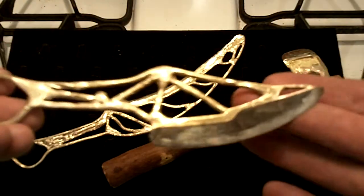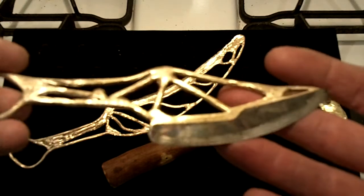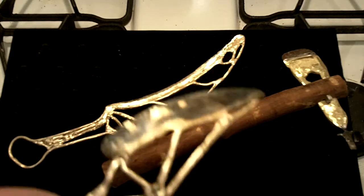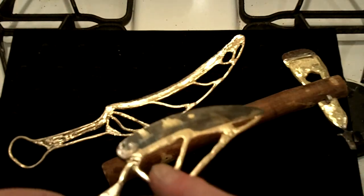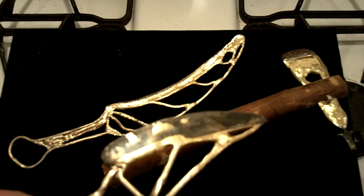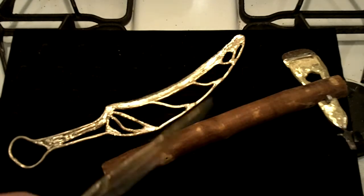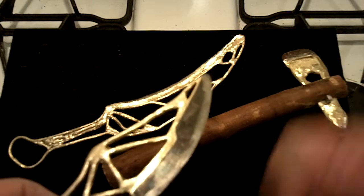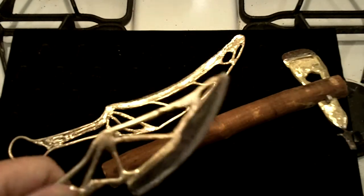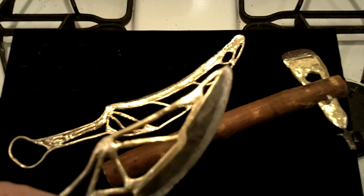this knife, and it's designed like a sushi knife where it's beveled on one side, but I made this out of a file that I brazed on, and so you can see some of the file teeth are still left. And what it means is that that's a flat side. You bevel down, and every time you sharpen this, you expose some of those file teeth, so it's always serrated. It's a very sharp knife.